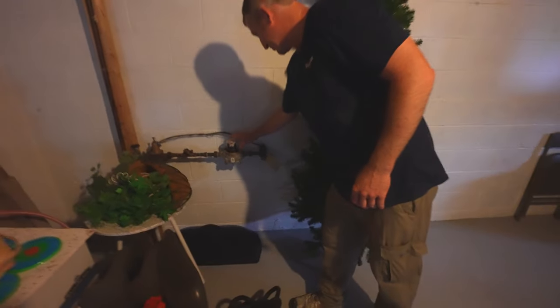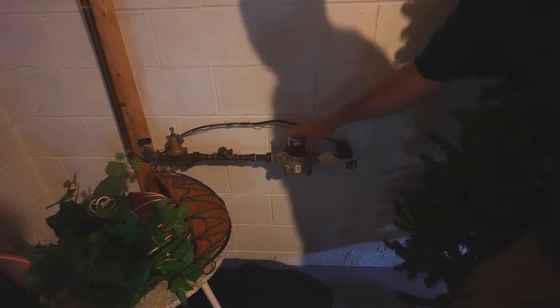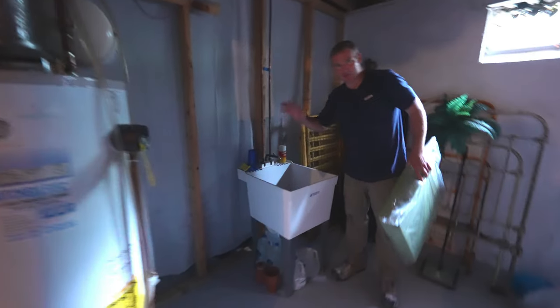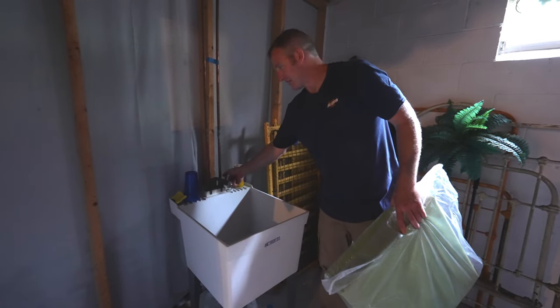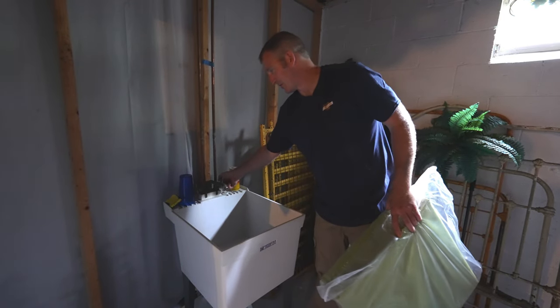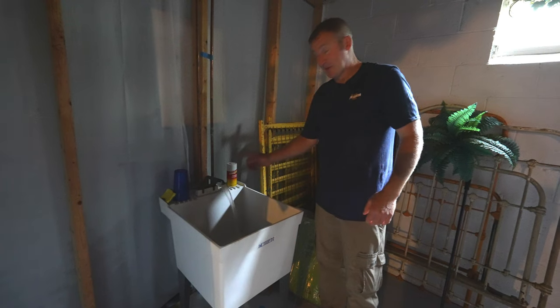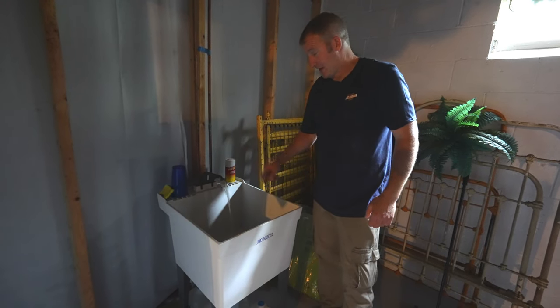Find your water shutoff. Usually there's a meter and usually there's a shutoff before it or after it — whichever one actually shuts off. Make sure you just shut that water off at the meter. I'd recommend finding a sink or something down in the basement so you can let all the water out so no water comes out of these valves, because everything's going to be pressurized unless you turn on the water somewhere. Make sure it shuts off completely, because if it doesn't, there might be a problem with the actual valve.